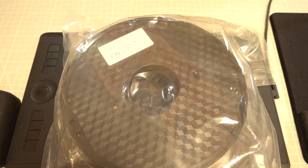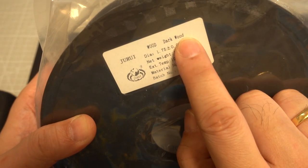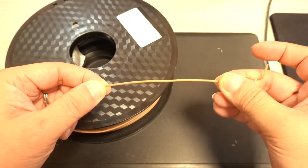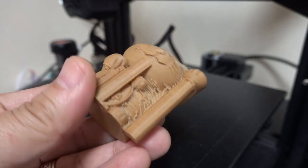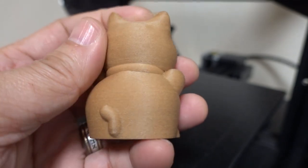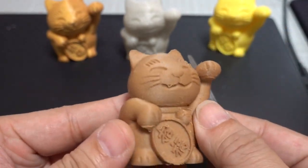Can other impurities be added besides metal powder? Let's look at this PLA — it says 'wood,' dark wood. Can wood also be printed? It turns out this wooden PLA is made of wood fiber, and using it produces a wood-like effect. Since this material is not a Creality product, the stringing is very serious. If you print with a third-party PLA that contains impurities, you can clog the print head easily. If you don't know how to replace or clean the print head, Carlos advises you not to use them. But this material really looks like wood after printing. To clean the stringing, you can use a heat gun to burn it, and if not satisfied, use a needle file to modify the details.